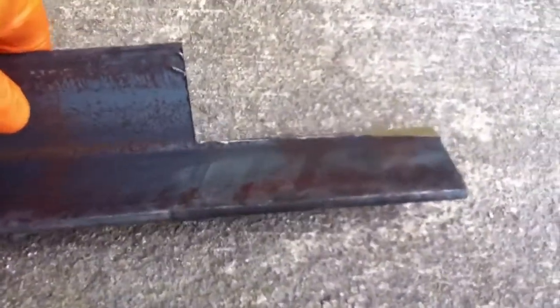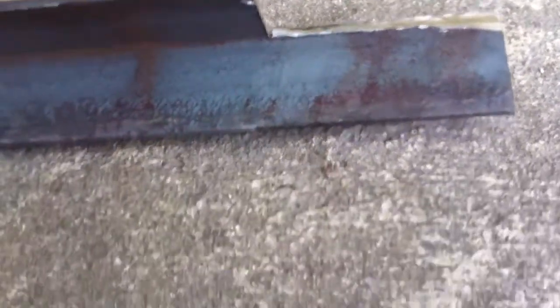You can see how I cut the angle — just a slice out of it to make a flat bar. I found I had to taper the sides a little bit because of how the gusset is — whether it got flexed, bowed inward, or was that way from the factory. I'm going to weld it in that way so I don't have to worry about it — it'll keep it right where it is, neither flaring outward nor inward.